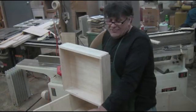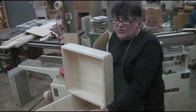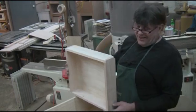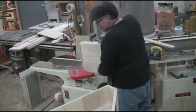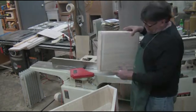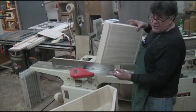All right, I was informed by the powers that be that I didn't explain what I just did on that jointer real well. So I'm going to explain it again. Here we go. The reason I bumped it this way first is because the rotation of the knives is going to cause it to cut into the wood, which will not give me a chip out.